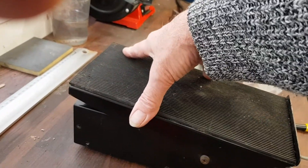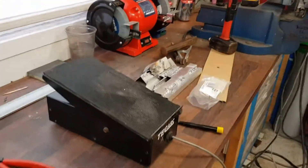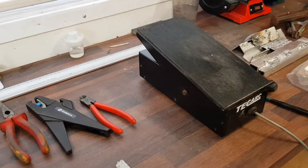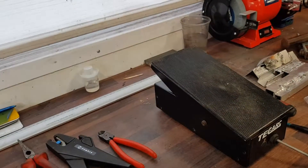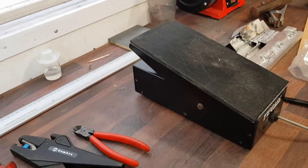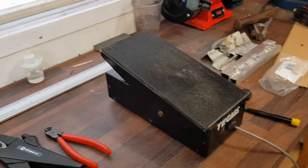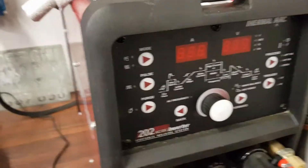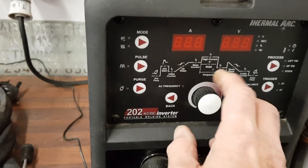So you've only got half of a pedal, which is no good to me. I wanted a full control. I also noticed while I was welding with it, it was stopping and starting — it would start welding then stop and start again. So obviously the track and the potentiometer were faulty. I've taken that off and managed to get hold of a 5k pot, which I fitted. And it still doesn't work properly.